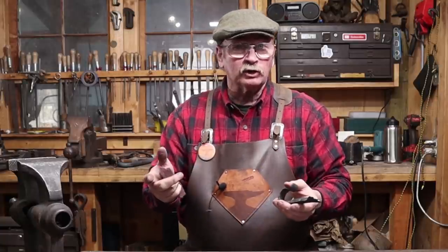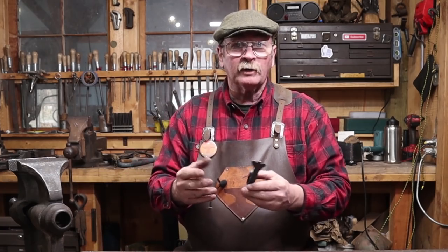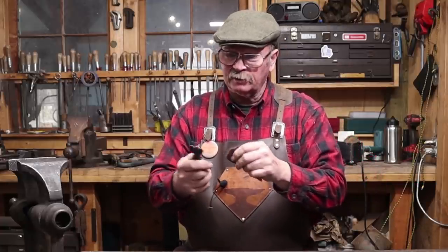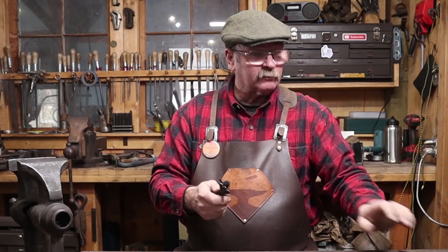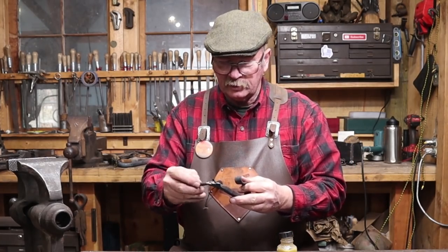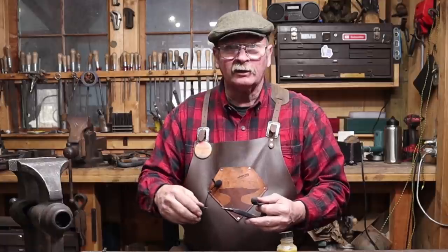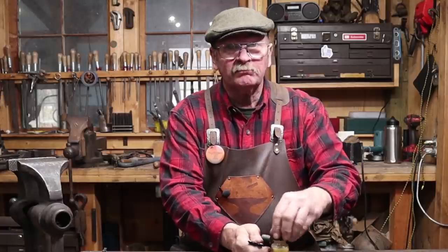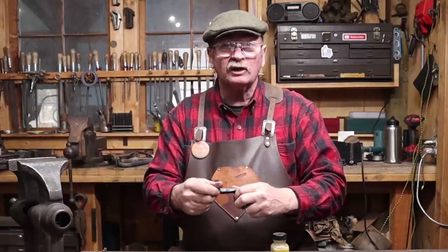Certainly if I wasn't doing this for a video I would probably put a little bit more time into it, but you can always spend more time fiddling with stuff trying to get it just right. I suppose I'll probably put it on Etsy — so if any of you are looking for a hook like this or just want a little memento of the show, you can look there for it. We'll use this same linseed oil and beeswax finish — I think it's about a third beeswax, a third linseed oil, and a third mineral spirits. I'll link to the video where we made it right up in the corner, so if you're interested in the exact formula, it's listed there.